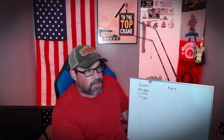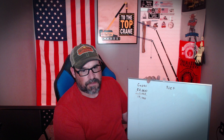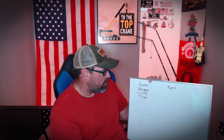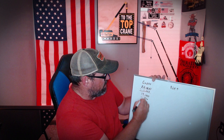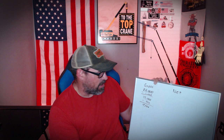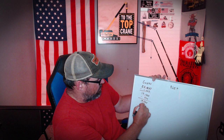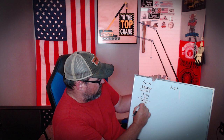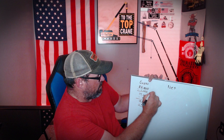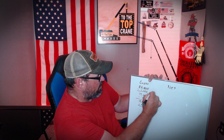Let's say with the way we've got the crane configured, we've got the jib stowed — folded back, stowed on the side of the boom. Let's say that deduction is 500 pounds, so we take another 500 pounds off, putting us at 18,500. Now let's pretend that we've got 500 pounds of rigging. We're going to subtract another 500 for rigging. So now we're down to 18,000.